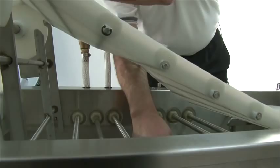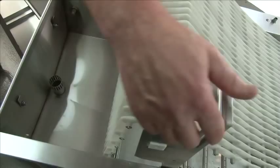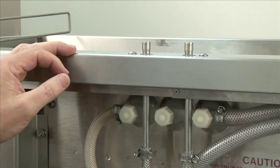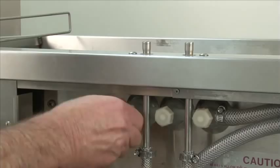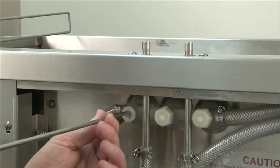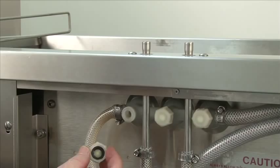Be sure all your nozzles are completely clear and cleaned. Once the bottom of the glass washer is cleaned, you are ready to lower your conveyor belt — make sure it's secured and locked in place. We've already cleaned the upper spray tubes and the spray hood is off the machine. We now want to clean the lower spray tubes. Simply remove the cap, use the scraper — which is fairly sharp — and run the scraper all the way through to the very end of all lower spray tubes. Take the brush as well. Ensure that the O-ring is on the cap, then reinstall the caps. The lower spray arms are clean. Note: we have already cleaned the jets with the jet reamer.